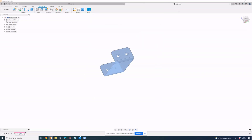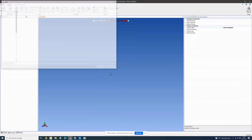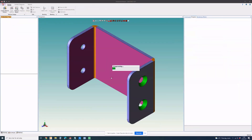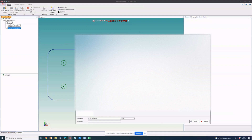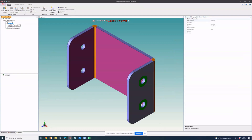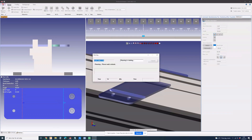We're going to make sure we're running our UiPath script. We're going to import it — there it is, conveniently enough. Since we need to choose the side with the fillets, we're going to choose this side. The script is doing its thing — a lot of stuff is going on in the background. It's renaming the layer names in the DXF, doing calculations for material cost, and making scripts I can double-click to print labels. It's asking if we want to bend the part — we do — so it's going to go into this program and produce the bending program.